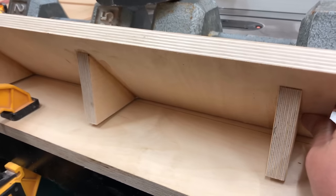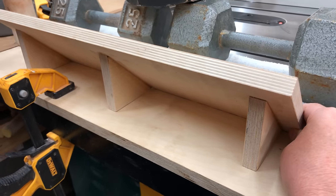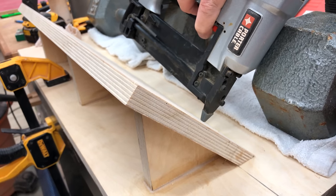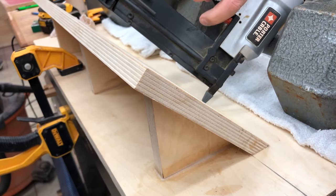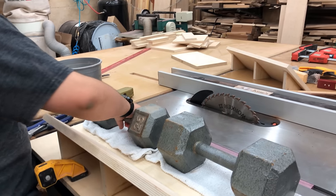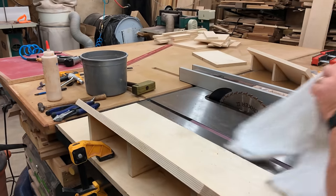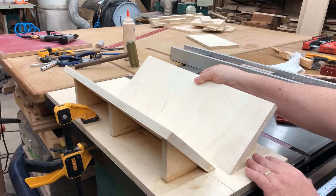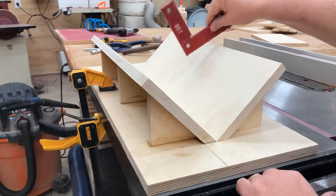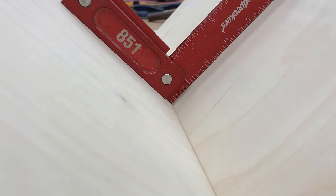You must use lots and lots of glue. There's a pencil mark there I'm lining up with — it's a straight line equidistant from the edge, which is going to be my center datum line to line this whole thing up. I'll shoot in a few pin nails to hold it in place while it dries. After drying overnight I'll glue the other side down, let that dry, and then check how the warp worked out. It does look like we have achieved a perfect 90-degree angle, and that's just what we're looking for.